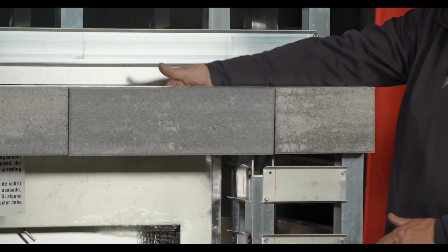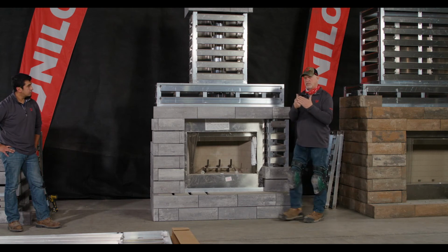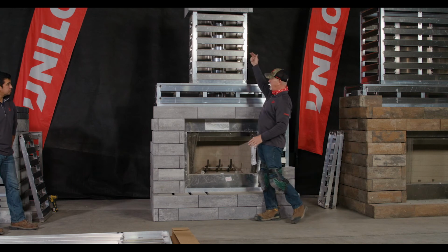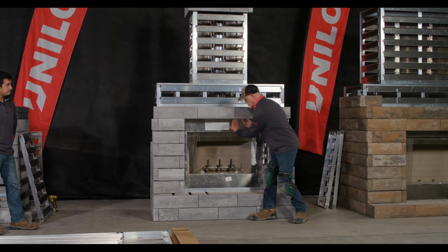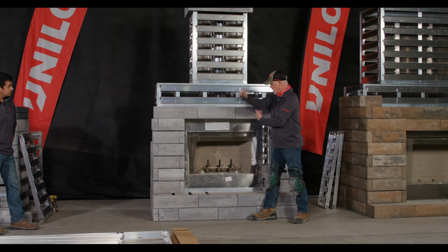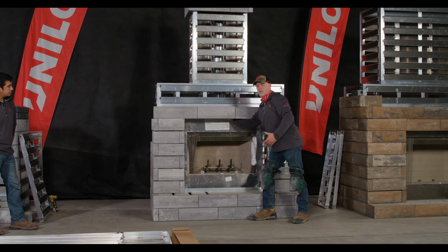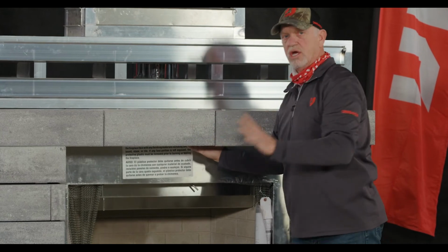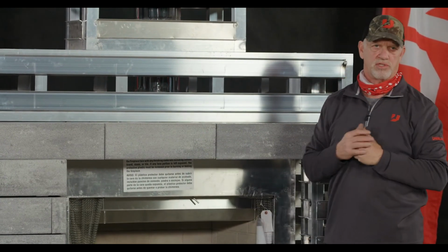But they're going to include some angle iron that will seal this off. It's not going to be a tight seal. We don't request a tight seal. Again, if we do have any backdraft, until we get enough flame generated here where smoke is going to be pushed out, obviously, through the chimney system, what you're going to see then is the ability for this to kind of work its way up on the interior of that and not leave carbon marks and prevent that homeowner from calling you and saying that that fireplace isn't working.